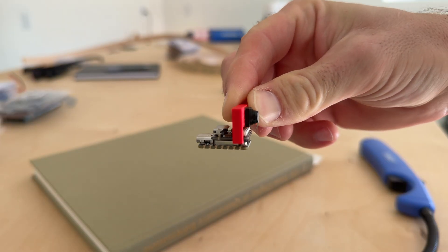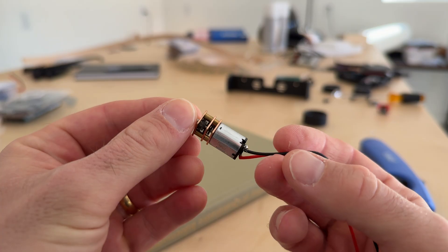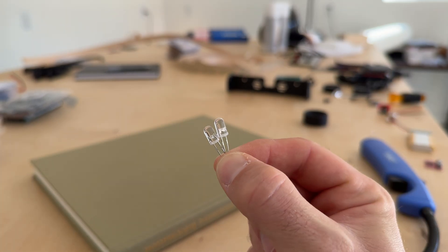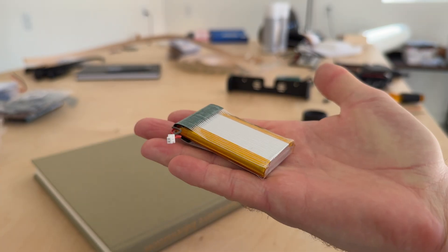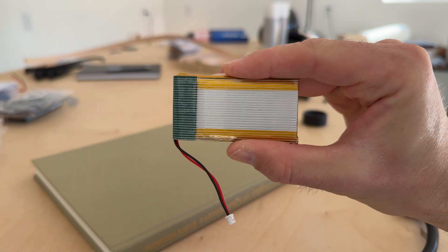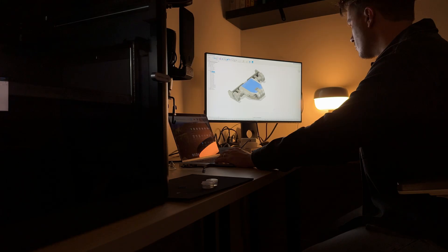To do that, we're going to need a few components. This tiny microcontroller and camera will serve as the eyes and the brain of our micro bulldozer, along with two tiny geared DC motors. Then to make sure that we can see anywhere, we'll add two LEDs, as well as a 3000 milliamp hour battery to power this thing for plenty of time for retrievals, and a DC motor controller to power the motors.